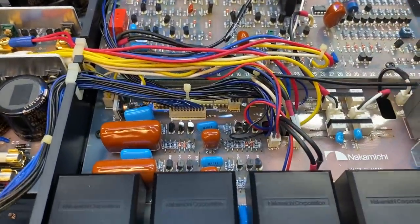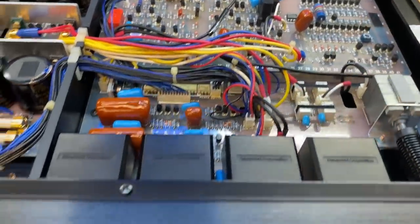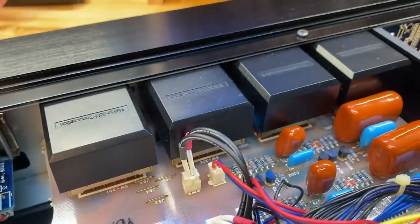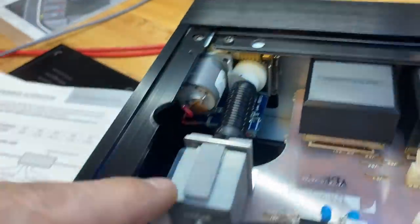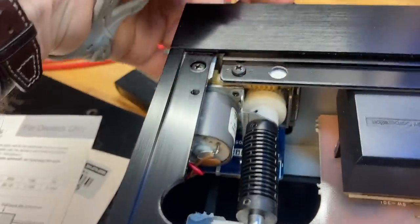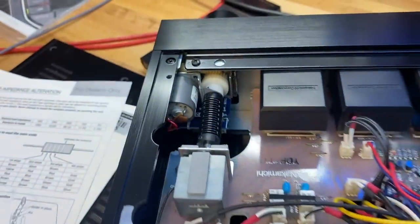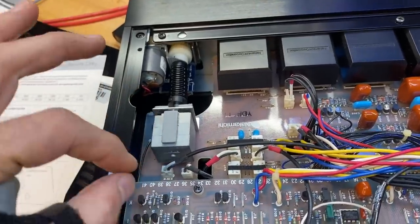The PC boards are made out of a material far superior to what you typically see from Japanese equipment of this era. And look at the controls themselves — look at the quality of these potentiometers for both the tone and the selections. Here is our volume control. The actual potentiometer sits on the board with a long flex shaft going to the knob in the front. The motorized section is pretty far away from the important bit, so they've located the motor at the front and put the potentiometer on the board — which is where we like to see it.